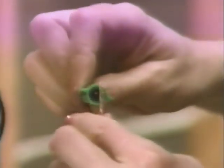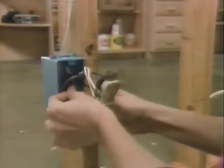Don't assume anything when it comes to safety. Test it, and test it again to make sure there's no danger of getting a shock. Just as before, we connect to ground by redoing the pigtail and adding a wire. The new white wire is attached to the silver terminal, the new black wire to the other brass terminal. We remount the receptacle in the box, add the cover plates all around, and we're ready to give it a try.